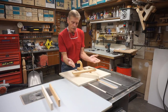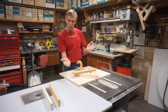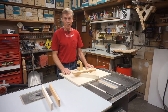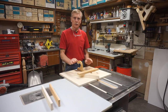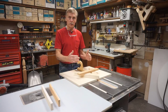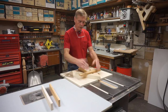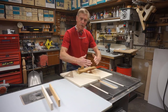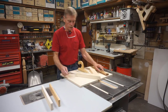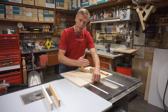With a compound miter box, having to change settings every time to cut one end and then the other end and still read to a mark would be overly complicated. The key to making a fixture like this work is visualizing the angle that needs to be cut and making a setup for repetitive cuts. I've used this very same sled with fences set at 45 degrees for similar compound angle cuts. The difference in this case is that these fences are set at 30 degrees off of a parallel line rather than at 45.